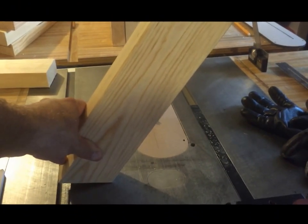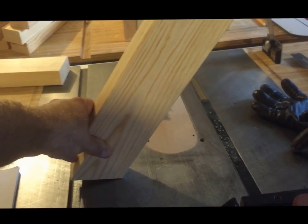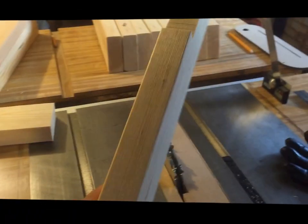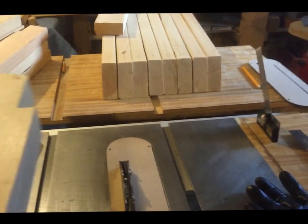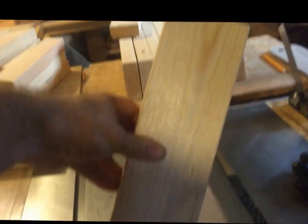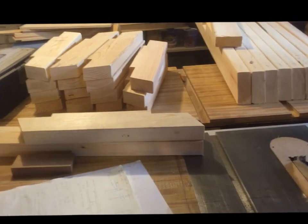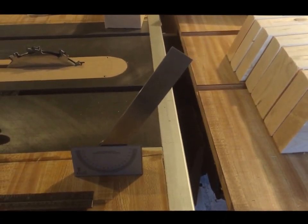This board here is cut at a 60-degree angle, but I think I'm going to go to a 55-degree angle to give it just a little bit more. With the mud motor mount I have, it doesn't care what angle the transom is at because it's designed to pivot all over the place. We'll have to do some more measurement, because if I put the transom at that angle, these frame members won't fit as-is — when you tilt the transom back you lose your height and the pockets are no longer at the right angle. You'd also have to trim the ends off at an angle too so everything lines up. So I'll sit down with pen and paper, do some math, and figure out the proper way to cut those pieces.